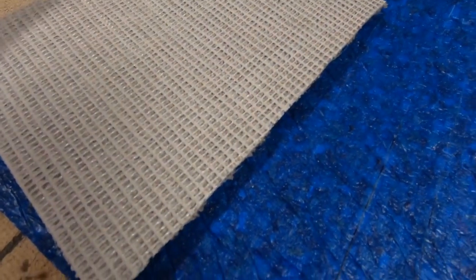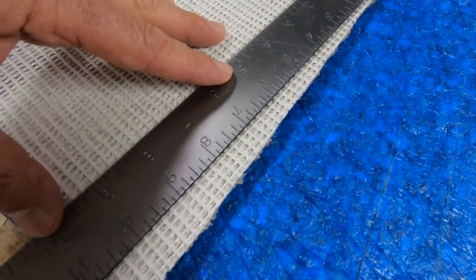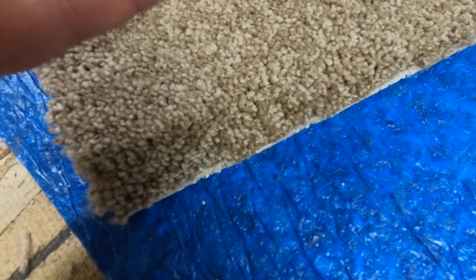When using a straight edge to cut the carpet to prepare it for the seam, you turn the carpet over on its back. You put your straight edge on the backing of the carpet and take your knife and run it down the edge of your straight edge. By doing that, you're not able to stay in between two rows of carpet — your blade is going to skip from row to row, leaving you with exposed portions of backing.